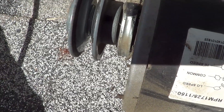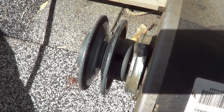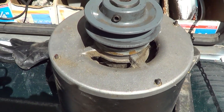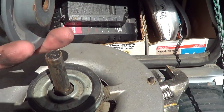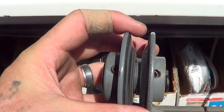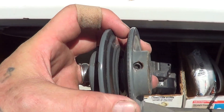Next we want to save the pulley. You can see it has a little allen wrench set screw — use an allen wrench to loosen it. Sometimes I suggest buying a new pulley because you can't always get the old one off. The allen wrench size is 5/32 most of the time. There are actually two set screws: one holds it on, and the other changes the diameter gap which changes the speed.